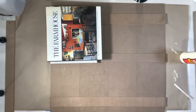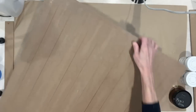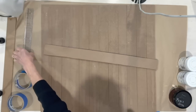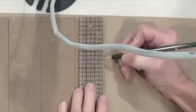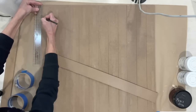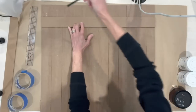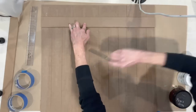Next we're going to flip it over and start putting the front part of our door on. We're going to take some of those same strips we cut for the back and use those on the front. I'm going to take my ruler and measure two and a half inches from the top edge, make a mark, and do the same thing on the opposite side. That's where the top part of our first board is going to start — line it right up there and draw a line across the top and bottom.